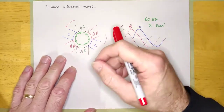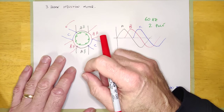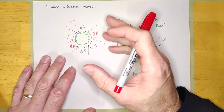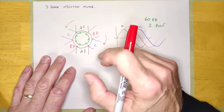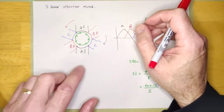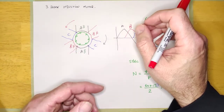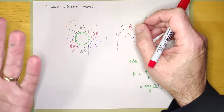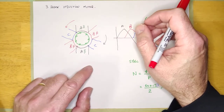The first thing you need to know about troubleshooting a three-phase motor is it's the same as a single-phase motor. If the thing is drawing too much current, most of the time it's going to be the load that's the problem. Just like a single-phase motor, as you load it up, it will draw more and more current. If you load it up over its FLA, it'll try to run there and it'll probably be tripping out the overloads.